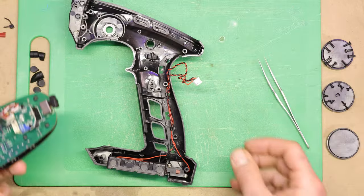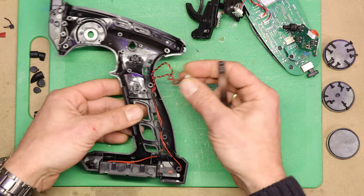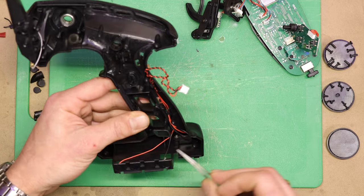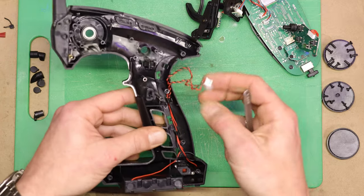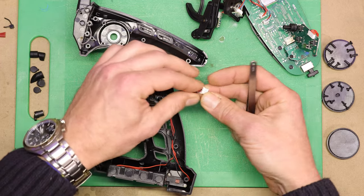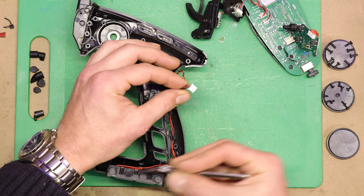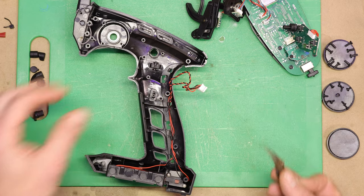So, now with this plug, I actually should point this out. This plug here has a weird setup. There's a 2S plug down at the base here, and there's 4 AAs that go in here. You can see there's a wiring harness off that, and a wiring harness off that. They both come up, and then they share a common ground, but one side is what I call low voltage from the AA slots, and the other side is the 7.2 volts nominal from the 2S.